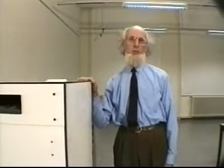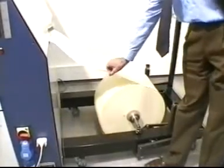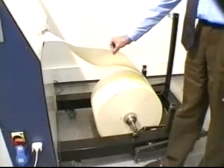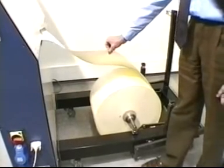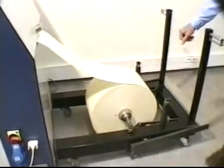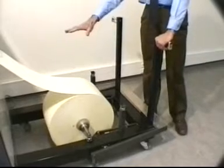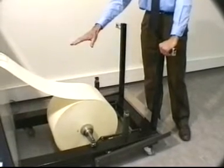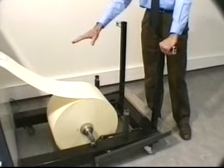We will start off with the paper supply. The paper is supplied to the machine from rolls — rolls of plain paper, without pin feed and without folds. These rolls are carried by a special cart that will take rolls as big as 100 cm in diameter. Such big rolls carry up to 50,000 pages of Braille.